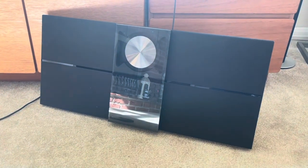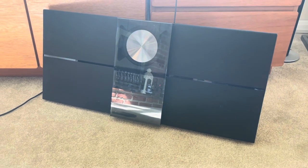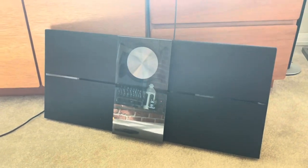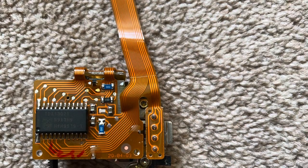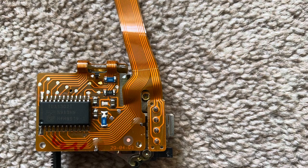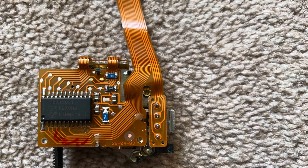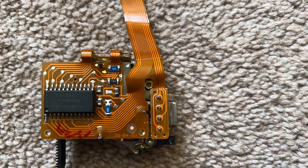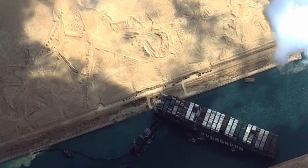My next thing to do will be to tear it apart. Since these CD units are so cheap to buy as one whole piece — the CD-M12s — I'm going to find the right CD-M12 to fit inside this unit. I bought a CD-M12.4 laser module; on the strip on the ribbon it says EF20A and that's the one you're looking for. It's a TDA1302 chip — you may also see them listed as a VAM 1202. I searched for CD-M12.4 to find mine and used a UK supplier because I wanted it in a couple of days rather than waiting four months.